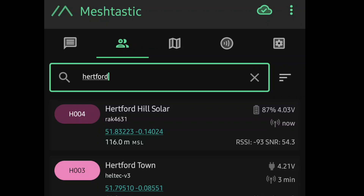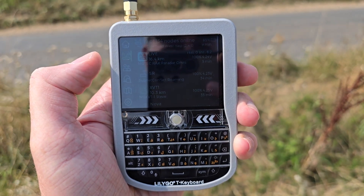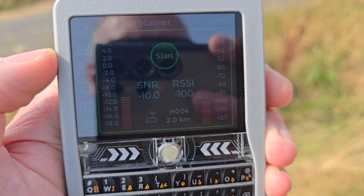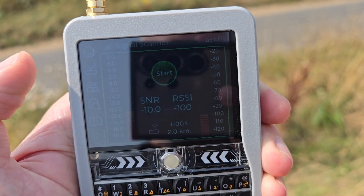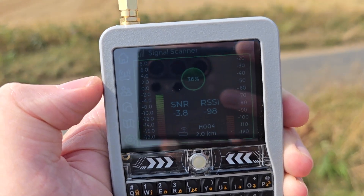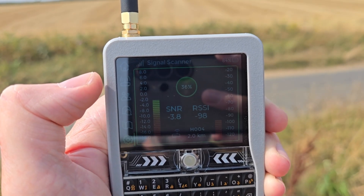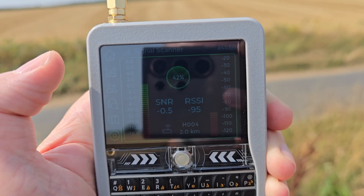Let's compare that to the T-Deck with its little stubby antenna. Something's happening - I keep getting messages coming in, so we're obviously connected to something. Look at that - I think it's a kite or kestrel! Okay, so with the T-Deck, let's find Hertford Hill again. I'll open signal scanner - all this does is send a position request like I was doing before on the app. You can see it's two kilometers away. We're getting -98 now. This is an omnidirectional antenna - these are known to be average. This one actually came out best for quite low SWR - 1.2 SWR on 869.525 MHz. So you can see it's very comparable to what we were getting on the SensCap; the lowest we saw was around -92, and this is doing -95 to -97 pretty consistently.